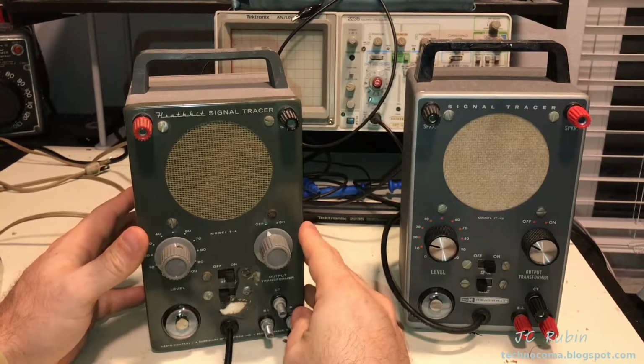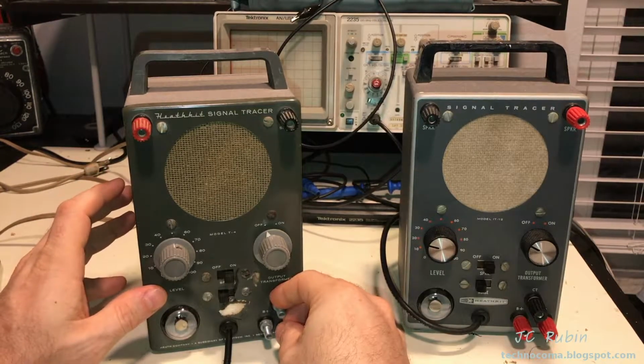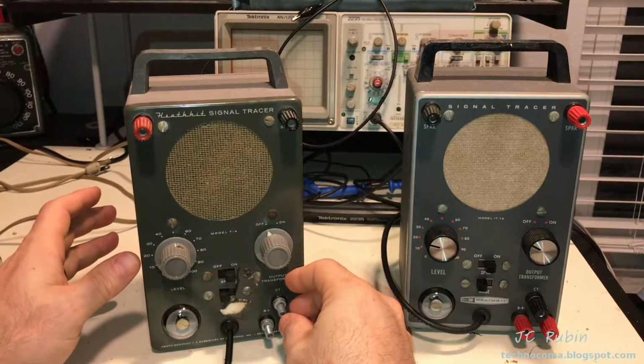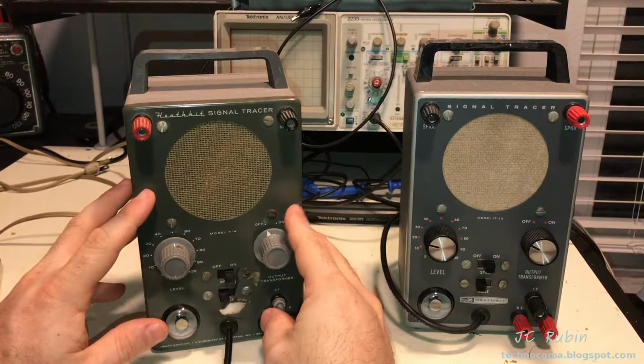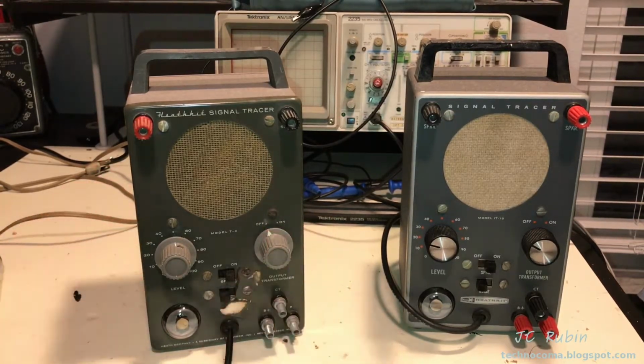And basically the input and the first stage is going to be pretty much the same, and then instead of going to that single-ended 6V6, it's going to go to that beam power tube, and it's going to come out to here. And what I'm going to do is I'm really going to keep this simple, and I'm going to build up on the design as I go along.